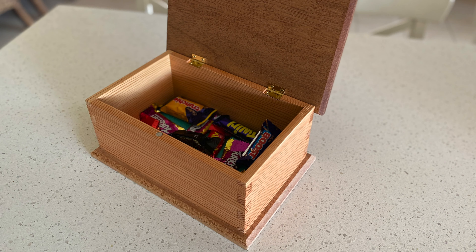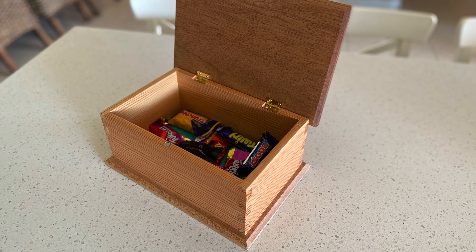Time to finish the box. I chose beeswax for the lid because it darkens the wood slightly and I was trying for that contrast between the lid and the box. Sometimes when using wax finishes in cold weather I like to use the hairdryer to get the finish deep into the wood. I used traditional wax on the box sides because it dries with a very light neutral finish. I reattached the lid after giving the box a final buff and polish, and gave it to my mum for her birthday with a few goodies inside.